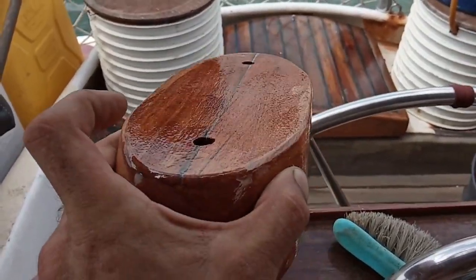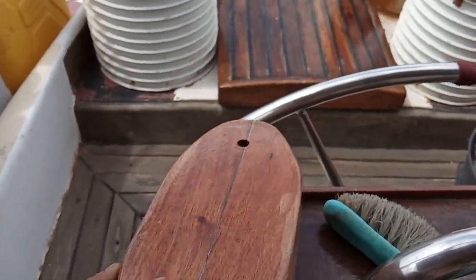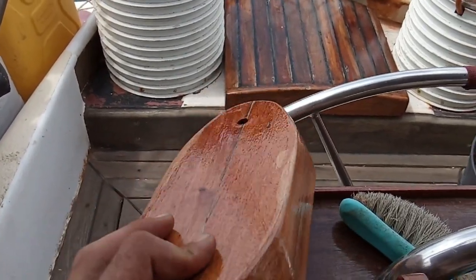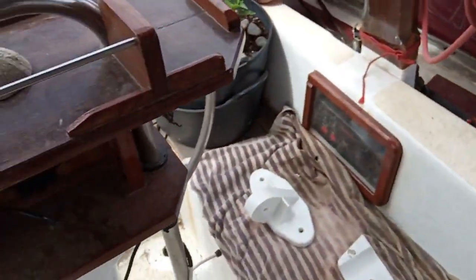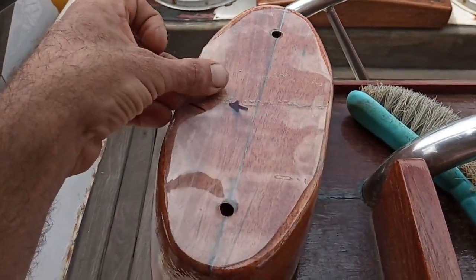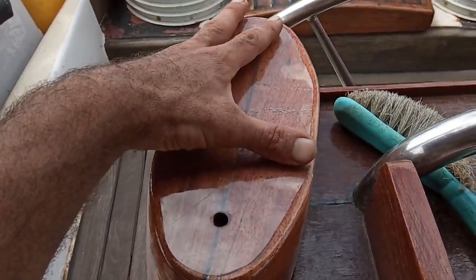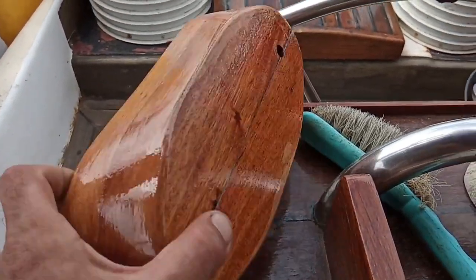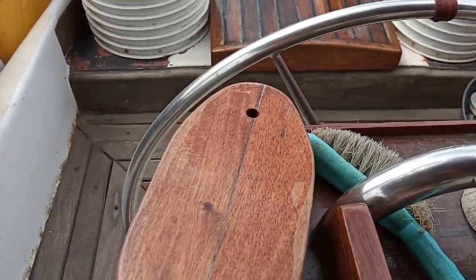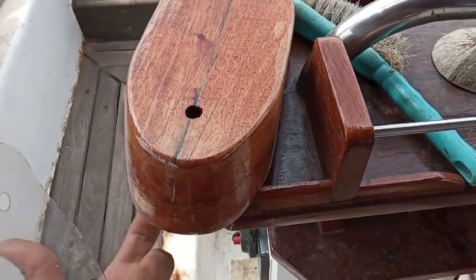That's four pieces joined together to make that, then epoxied over and then varnished over the epoxy. Well, epoxied over on this side here, which is going to get the sun. And you see, unfortunately, the epoxy is a lighter colour, but this is going to be covered over. Because I want to be able to remove the wind vane, I'm not going to use Sikaflex on this side. I've just made a PVC gasket to protect everything and keep it somewhat sealed. And there'll be Sikaflex on that side, so I can remove the Hydrovane without removing the spacers, like I said.